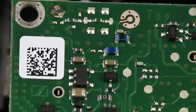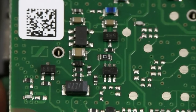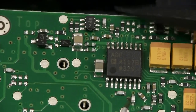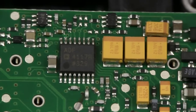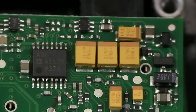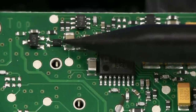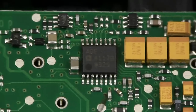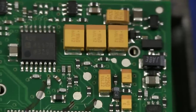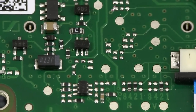There's our antenna output over there. There's a nice little distributed element filter going on there - that's probably the RF output power transistor or something like that. I'm not going to decode those SOT-23 devices. There's probably some local voltage regulation around here. They're going to have the crystal oscillator associated with that PLL somewhere - I can't see it. I think that might be a little common-mode choke between those things. Just some power regulation with big tantalums for bulk decoupling.